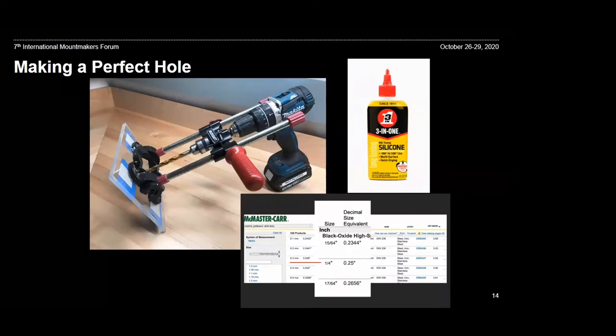Because the exhibit design was mount posts emerging from the plexi in a pressure-fit format, the sizing of our holes was very important. Plexiglass has a tendency to melt slightly during drilling, and the holes can become oversized or a melted mess. I've used many different drill guides over the years — the kind attached to the screw gun with a spring action, holes in a heavy metal plate — but I never really trust them. Levels mounted to screw guns — forget about it. My post-drilling life changed forever after using retrofitted tabletop drill presses. We could achieve very controlled straight holes. Using fresh drill bits and silicone lubricant was our best approach to clean holes without melting or bit chatter. In some cases, we also used metric-sized bits.